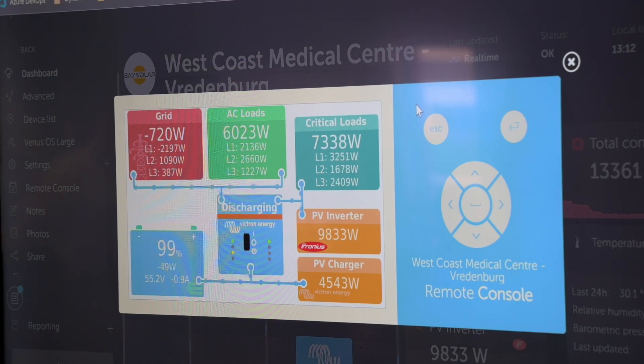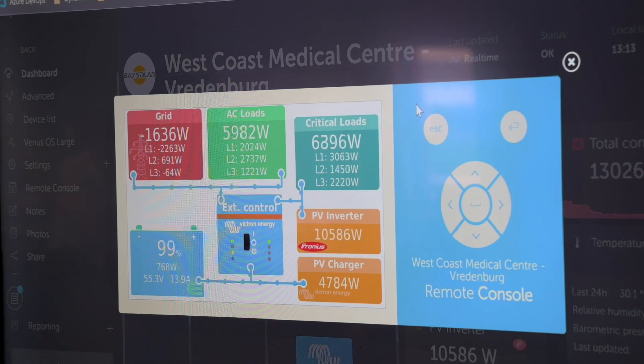The inverter is going to have a maximum capacity of 5 kVA or negative 5 kVA to charge the batteries. If you exceed that on the output and get reverse feeding, it's going to damage the output circuit. So you can't say I've got a 5 kVA inverter and a 5 kVA grid tie — I can now run 10 kVA.